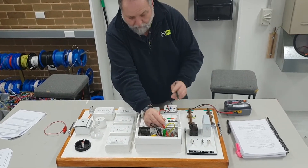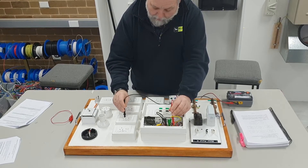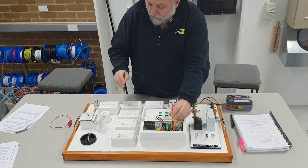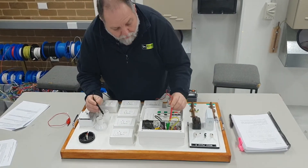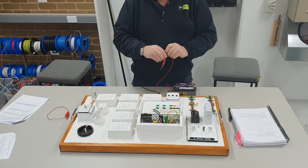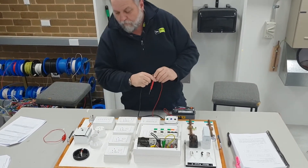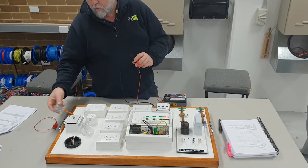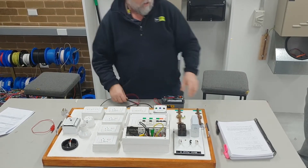I'm holding that on there - I've got zero. I'll do the other one over here. What's this proving? If I go back to zero, it's continuous. If there's a fault, I know the fault current path. In the back of the batten holder there's a little brass tag behind the two pins - put that in and it'll read zero as well. Don't test the two pins as they're active and neutral and spring-loaded.